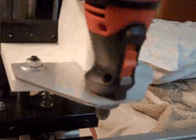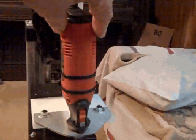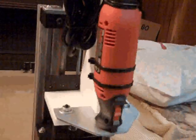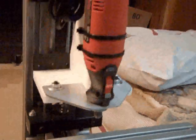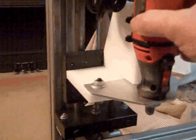I do have these pieces sort of crudely made. They will encircle the router here and I'll stick a bolt to this vertical piece to get more support. Actually, it's not bad right now — it's fairly stable. I don't suppose with the one-eighth inch tool that you'll have much feed rate to worry about lateral loading on the tool itself, so I'll probably just try it with these tie wraps first.